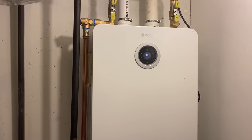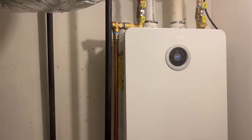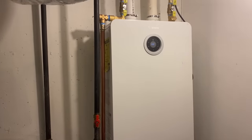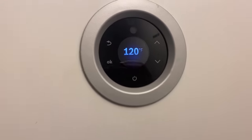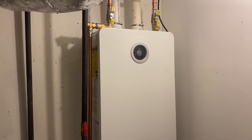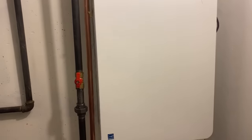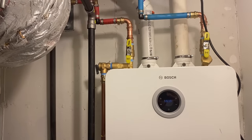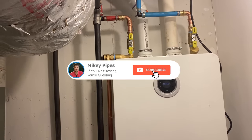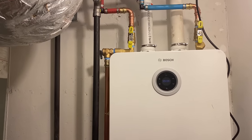Let's review: seven models of the 9000 series — sleek, slender, beautiful, and most importantly energy efficient. This is the premier line — this is the 9900 ISE. It's got the glass front with integrated Wi-Fi. What's great about the Wi-Fi is that you can control this thing remotely via tablet or phone: temperature, recirculation, and you can also monitor usage. As far as specifications, we have a 22-to-1 turn-down ratio — the most efficient machine you can get. There's basically 22 different speeds that this thing runs at.